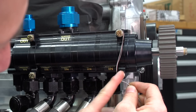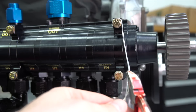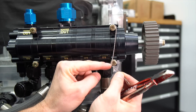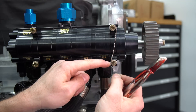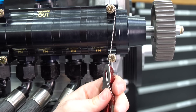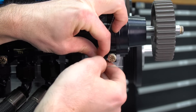Go ahead and grab the safety wire — a little bit shorter than you think you need. Clamp the safety wire pliers down and start twisting. Once we get it twisted, not too tight. Don't go too fast either, because if you go too fast you'll heat up the safety wire and it'll want to break. Twist it and measure it. Typically you want to err on the side of ending the twists a little too soon — that way you can grab it again with the pliers exactly where you need it, lock it down, and put another couple of turns in.